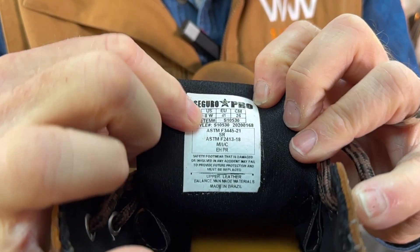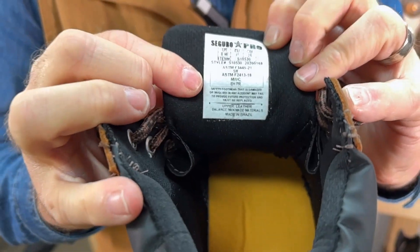If you're walking across a job site and you step on something like a screw, that protection is going to be there. This guy isn't even in the construction business — he just jumped out of his truck onto a screw — but he had puncture resistant boots and look at how it protected him. Make sure the label inside says F2413-18 PR. That tells you it's been tested for safety toe and for puncture resistance. For safety professionals, this is your insurance. If someone didn't wear footwear with that label, you can say they weren't wearing the proper appropriate footwear.